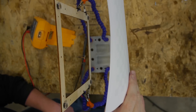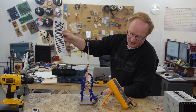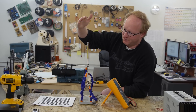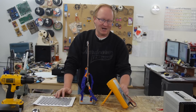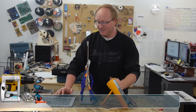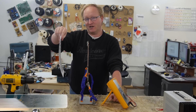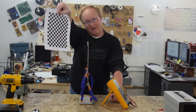I've got the four photoresistors hooked up kind of like a picture frame. I printed off this checkerboard pattern, and I'm going to hopefully use it with the flying spot detector. Pretty much doing anything in front of these sensors causes them to change because they're in parallel, which means the light is averaged out between all of them. What I want to do next is rig up the record to spin here, shine a light through it to get the flying spot going, set this up at a fixed distance on a flat piece of material, then scan the flying spot across the checkerboard and look at the output of the photoresistors with an oscilloscope to see if we can detect a pattern.